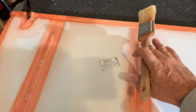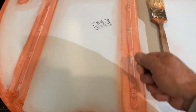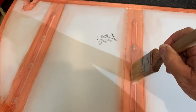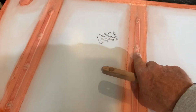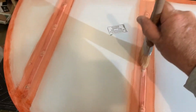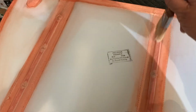And then you lay that tape on it like I talked about, and lay it gently, and don't pull it. And then what you'll notice is if you pull it, then you're pulling it over the high spot of these rivet heads, so you don't want to bridge it so much. You want to let it lay down into it. So I start in the middle with a wet brush and just start pushing it down like this and spreading it out and working it back this way, but not pulling the tape.